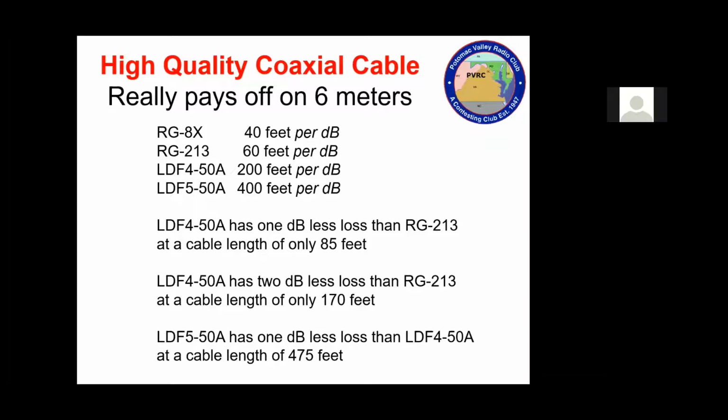And there's a third way that flexible jacketed cables like RG213 and LMR 400 get damaged, and that is during lightning strikes. If the coax cable is not bonded to the tower at the bottom of the tower and at the top of the tower, a voltage gradient will develop, usually during a direct lightning strike. And when the coaxial cable shield arcs to the tower, which it will if there's a voltage difference, it creates pinholes in the coax cable. You probably won't be able to find those pinholes, but I'll guarantee that the water that's going down those coax cables will find the pinholes, and it'll wind up inside the coax and ruin it very quickly.